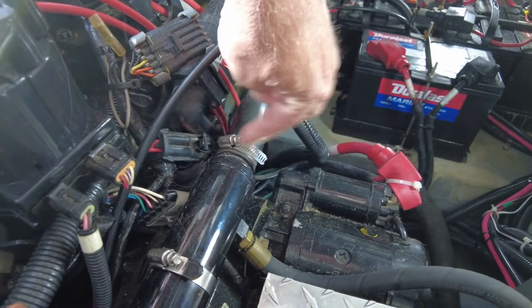Looking under the lowest step at the forward end of the engine room, there is another forward bilge pump on a float switch. You can manually test these by turning this little dial to make sure it hasn't blown a fuse and the pump will still work if needed.